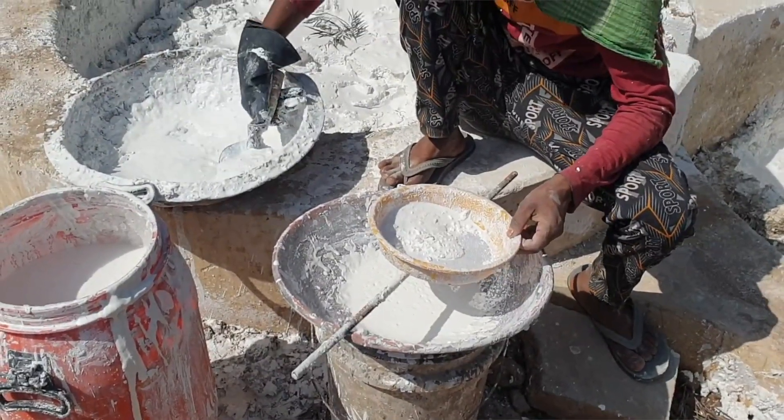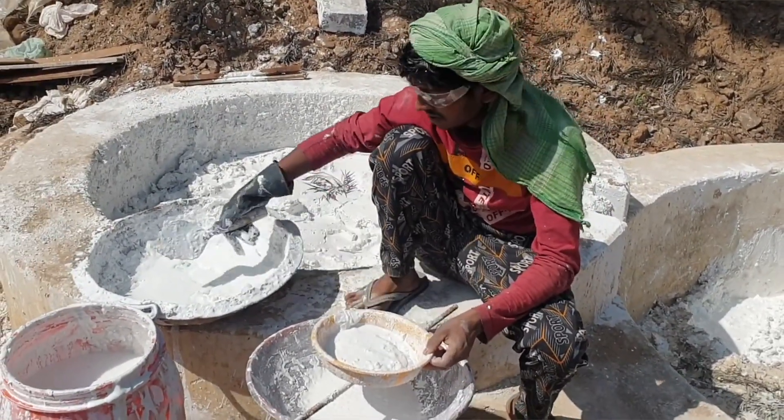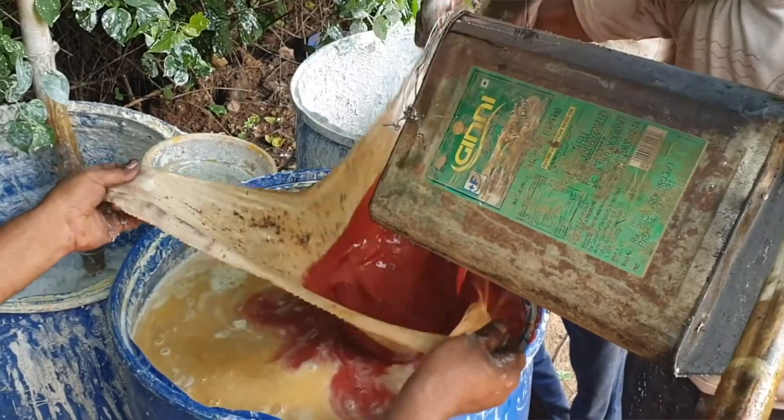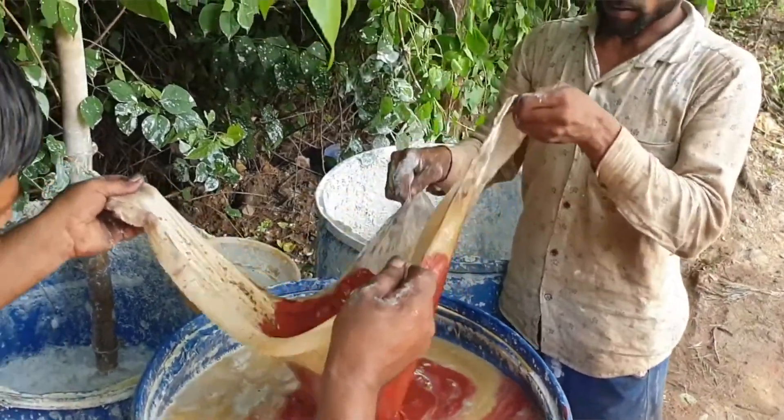So while it is true that you need to apply a coat of lime wash every year on your exterior walls, the good news is that it is extremely easy to do. You don't need to do any preparation of the walls — no POP, no putty, you don't even need to sand them down. You simply need to pick up a brush, make your lime wash solution with the right pigment, and get started with the painting. It is so simple that even an unskilled person can do it. Mixing pigments to get the color of your choice is extremely easy — just mix the pigment in a smaller batch and sieve it through a fine cloth so that you don't get any lumps or concentrated particles of pigment within your lime wash.